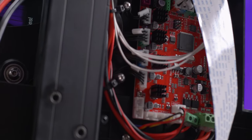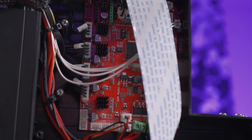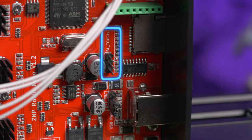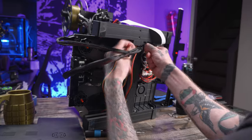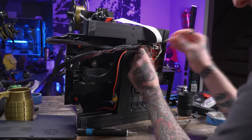Once the bottom cover is off, we can see the Robin Nano based main board in this thing with built-in TMC drivers. This is overall a pretty solid 32-bit ARM processor equipped main board that Elegoo picked for this machine, and it does have a dedicated BL Touch port right by the memory card slot on the board. We simply need to follow the rest of the harness into the electronics box and then go directly to our BL Touch port.